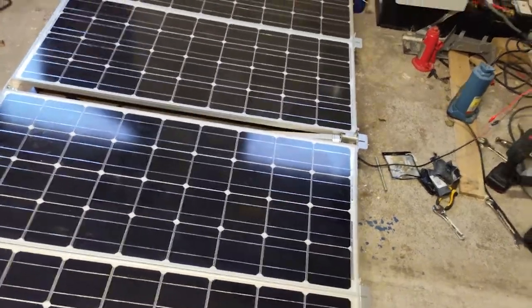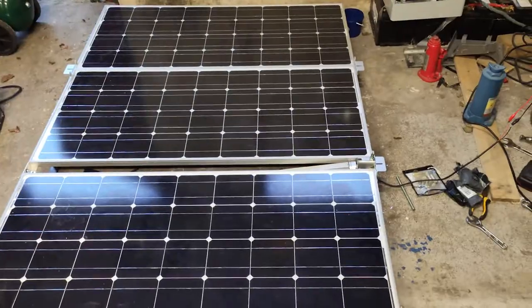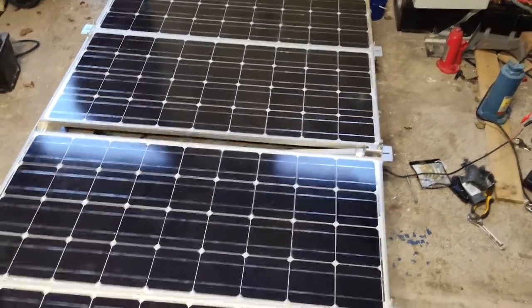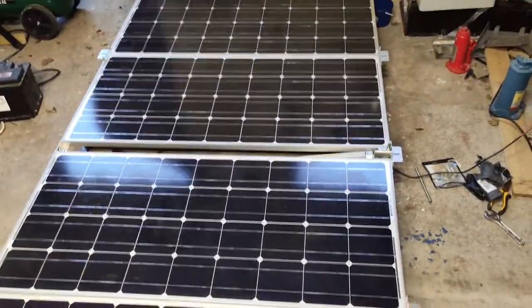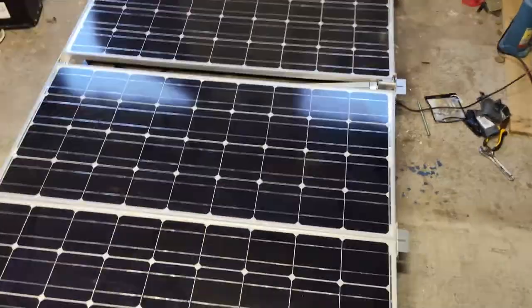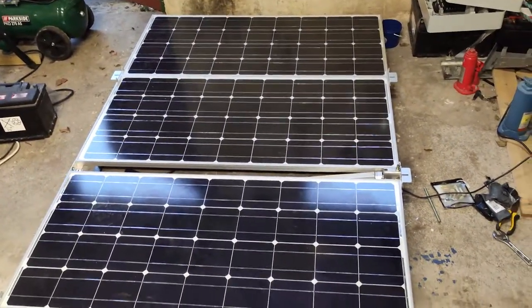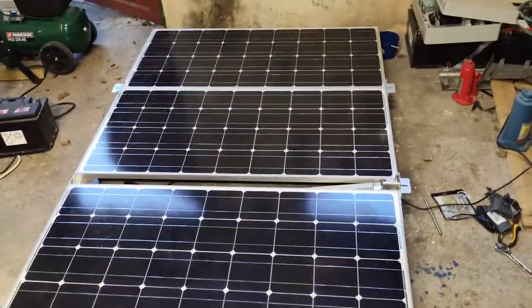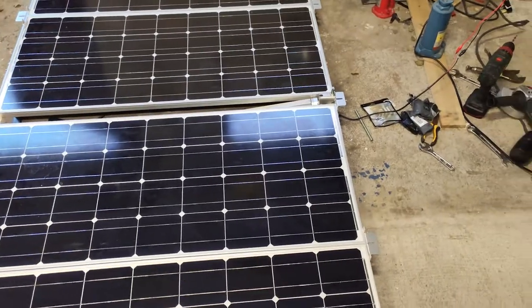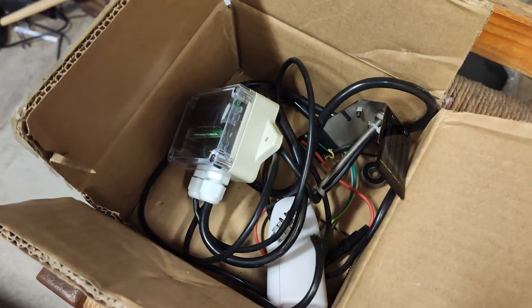Now, the reason I'm doing that is I haven't actually seen many people do this on a self-built campervan roof, so that's why I'm recording this. It might be useful for people. But having your solar panels angled at the sun, depending on the time of year, can increase your wattage, your power generated or captured by the solar panels, by 30 to 35%. So if it all works, it'll be worthwhile. So have a look out for the next video where I will be mounting it on the roof and showing this automatic control system in action.